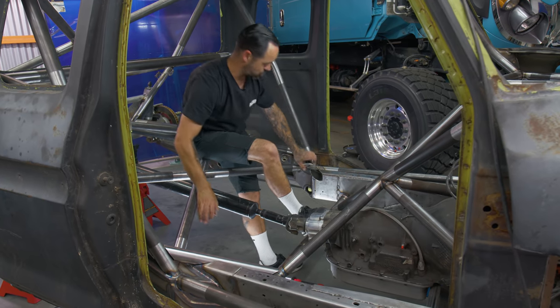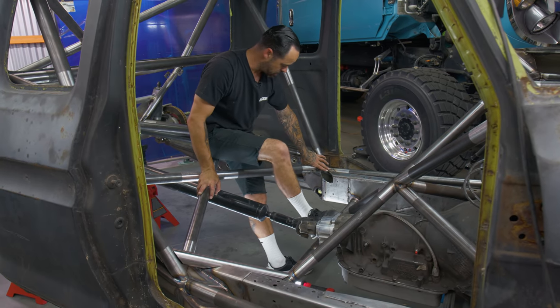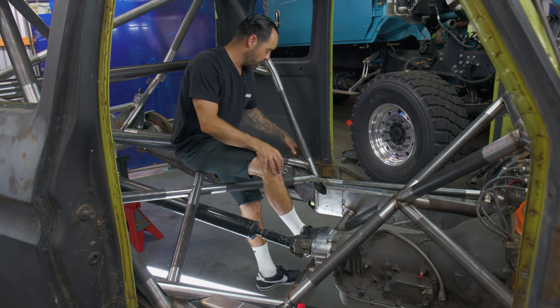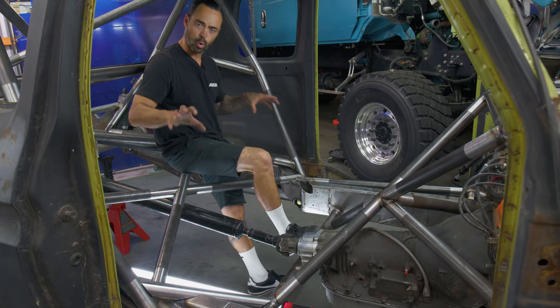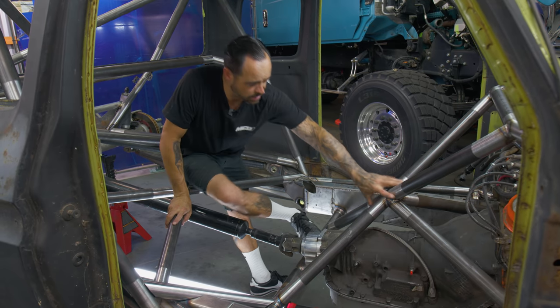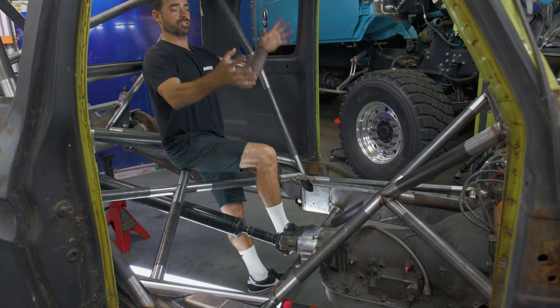And then these tubes drawing back into this little core here. And this core is so important because not only is that your B pillar section, but that's also all your pivots where all your load's going. And that's where all the rest of the rear of the chassis is starting. So it's really important to find these core areas and tie them in how you need to, where it makes sense. Like this core here is a great tie-in of rigidity in every point.